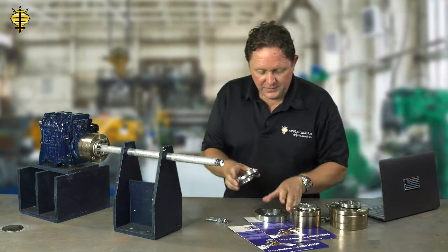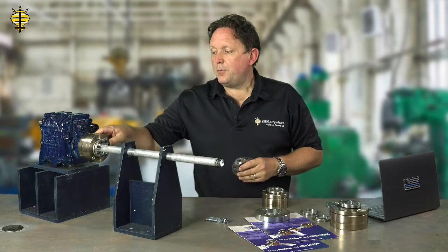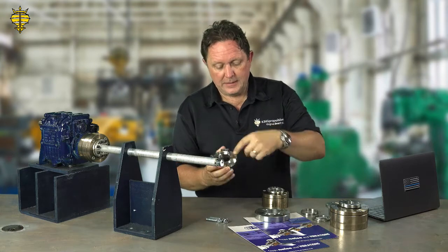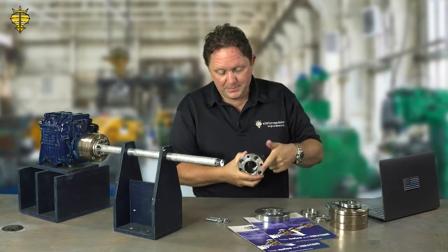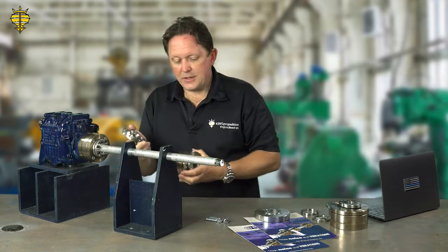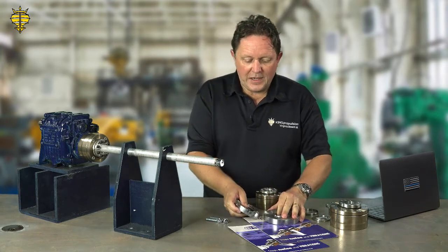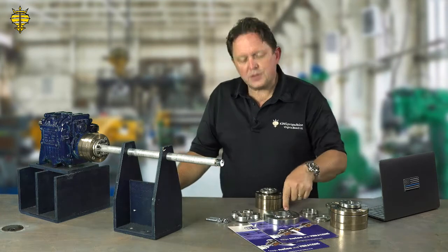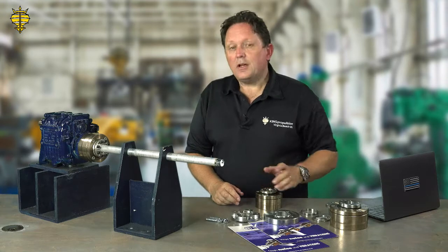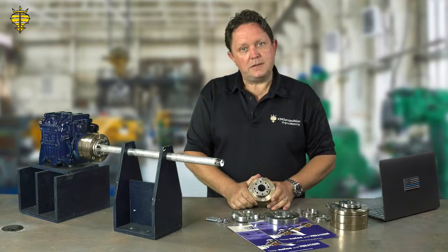We also have another system — a different type of adaptive flange. If you have a V-Drive system, typically the output flange of the transmission has threaded bolts. So you would drop bolts on this side and clamp it here, and then the bolts become captive. You can then screw the bolts in with an open-faced spanner into the output flange of the transmission. For the same Sigma Drive, here are just two adapter flanges. We have various different configurations — we can go small for seven-eighths shaft diameters and have three bolts, and we can do custom stuff as well, with a slight increase in price.